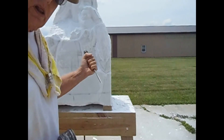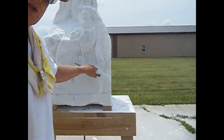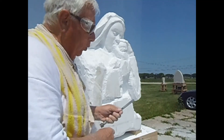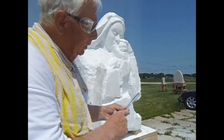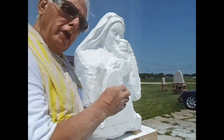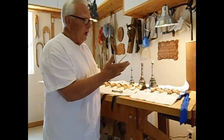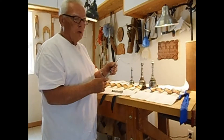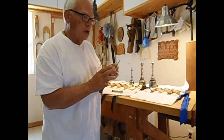You can hit this harder than a carbide tool. Carbide is brittle and it's going to break. They work for stone carving, but if Shaft tools will do this, they'll stand up to wood carving very well. For a wood carver, the toughness of Shaft tools really pays off in resistance to chipping on the cutting edge. When I'm done with this I can just take the handle off, put the wood handle back, and I'm back to carving — I haven't hurt the chisel at all.